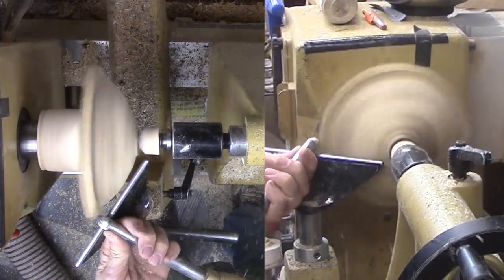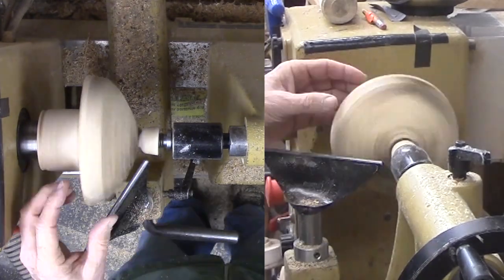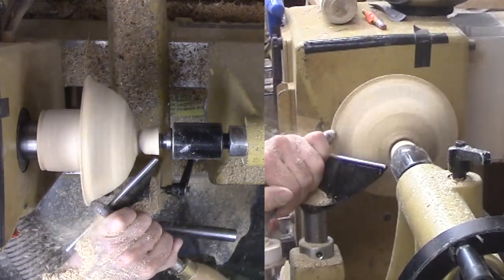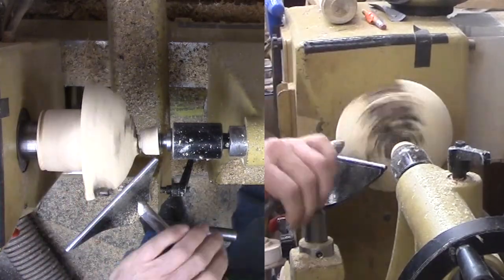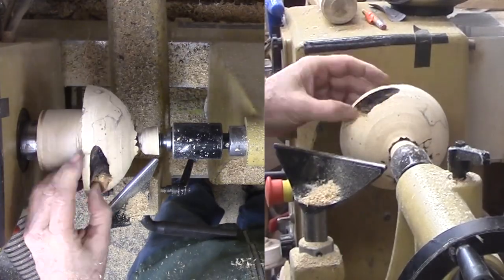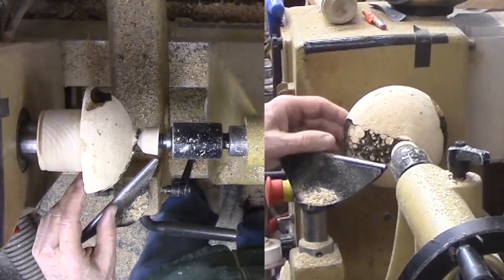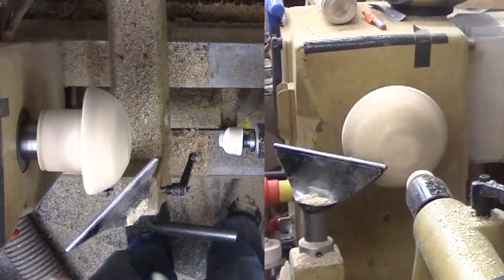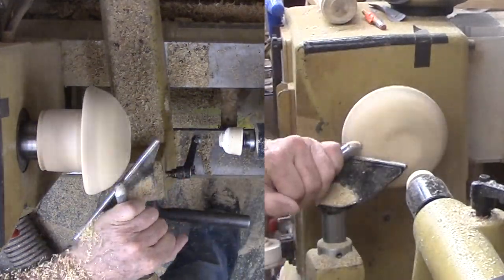This early turning is also when I'm often taking rough cuts. Almost like turning a bowl, I work down the exterior from the bottom and up. While the burl figure is wild, this is still my best bet for cutting into side grain. There is a big void on the side — I decide to leave it and not cut it out, as that would make this a very small bowl. Usually I would be cutting a tenon; instead I'm going for finish cuts: a minimal foot and a cove bottom. I can scrape a little using my skew as a scraper.